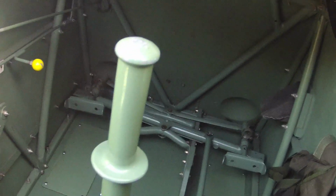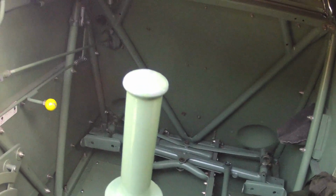Don't forget to have a good look in the front cockpit for any foreign objects. Look under the seats, and if the aircraft is to be flown solo, the seat squab should be removed and the harness secured for solo flight. The fuel system water drain is by the sluice valve on the bottom side of the tank.